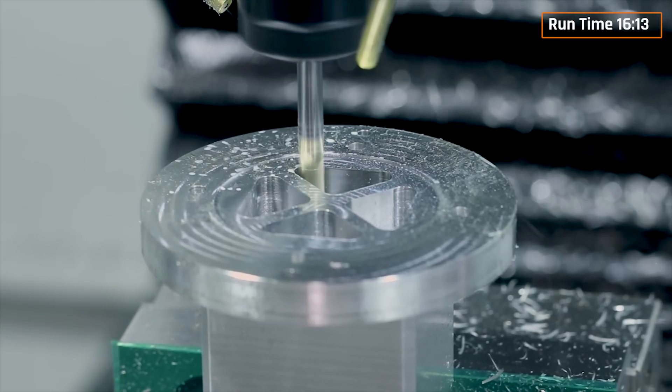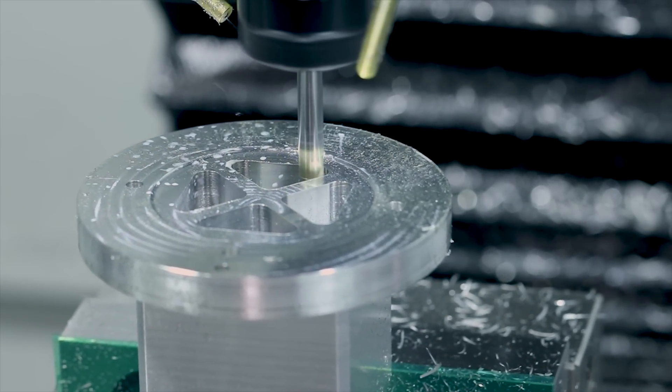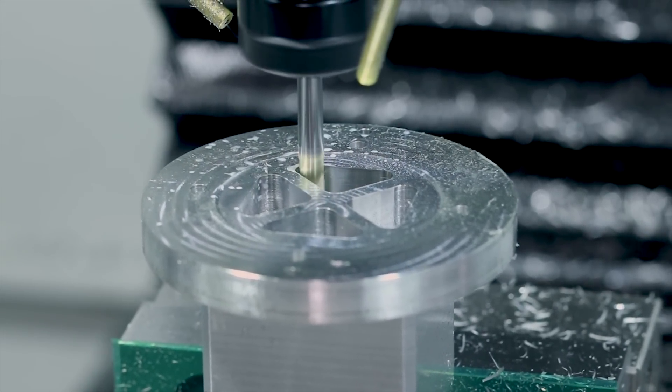You can see a few of these corners that I pre-drilled on the triangular through holes didn't quite clean up from the contour pass, so in the future I would go a bit smaller on that drill size.